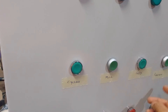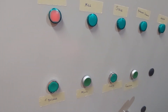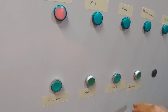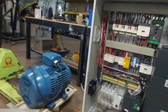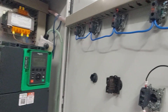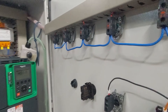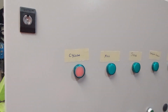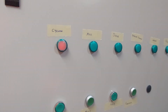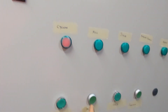For the feed, the flexicon is independent — it has a different panel with just a start/stop button. That start/stop button has been extended to this control panel, though it has not yet been wired into its final position in the factory. I will extend the start and stop wire control to this panel. I'm going to start the mill now.